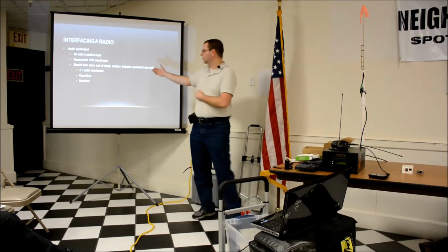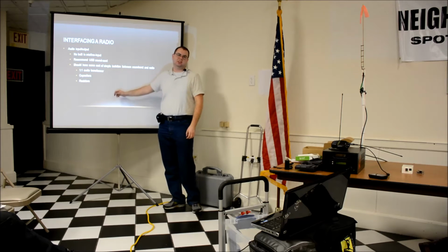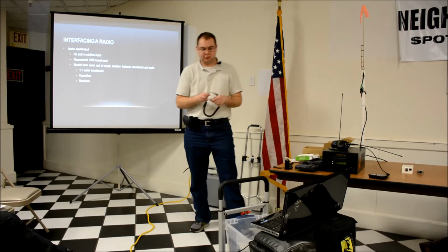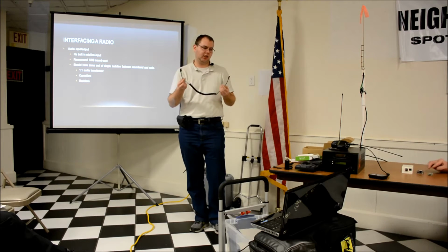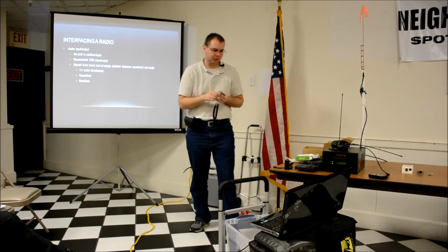As I was saying, there are a few different ways you could do isolation. The one-to-one transformers, the little Altoids tin that's going around, there's a couple of ceramic disc capacitors for isolation in it. I've seen a lot of people use resistors. Well, it's not for a Raspberry Pi. I've got this cable that is for connecting a cell phone for APRSdroid to a Chinese Baofeng or TYT or Kenwood style radio. All they did is put a couple of resistors in line between the microphone and speaker. That's all they did for isolation.